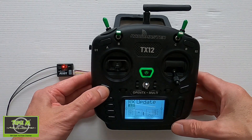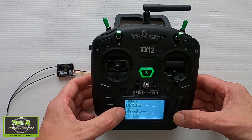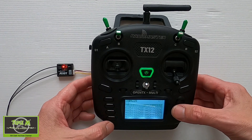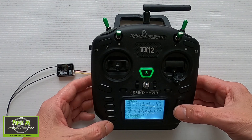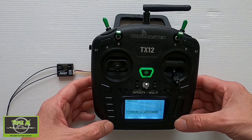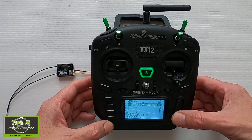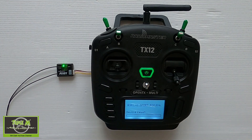Now we need to go to our System Menu, go across one, and go into the Firmware section where we earlier put the firmware for this receiver. You can see all the firmware on the drive. Make sure you pick the right one — this is the R161 and we're updating it to version 2 of the ACCST firmware. Push Enter, choose Flash External. You can see it's now writing. Don't interrupt it once it has started, so make sure your radio battery is fairly well charged.